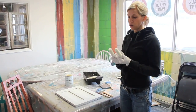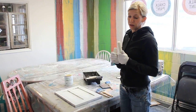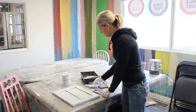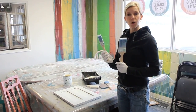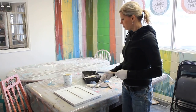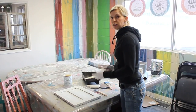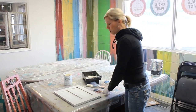We love to use these low nap velour rollers. The less texture on the roller, the better, because it's going to leave very little texture in your paint as you roll it out. Another great tool is Annie's flat brushes — she has a small brush and a large brush. When I'm doing cabinet doors, I often like to use the small brush for the smaller details, but you do have a large brush available if you have a larger project.